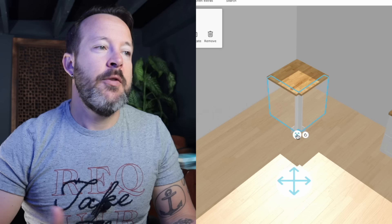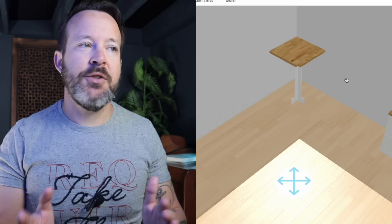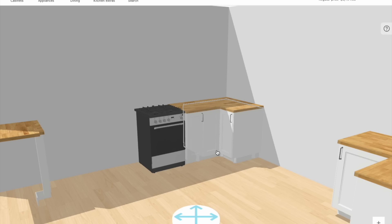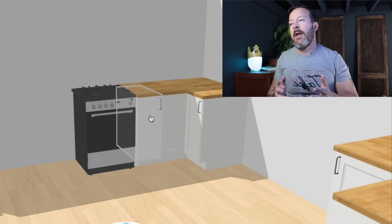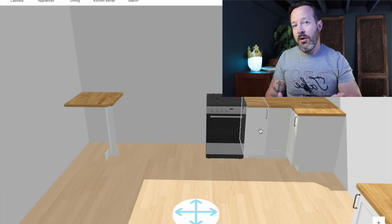This is a 4-inch by 4-inch corner filler, already set up in the IKEA kitchen planner — just two fillers on a 90-degree angle attached together. This allows you to create a blocked-off corner section with ease. Why would you do a blocked-off corner? Maybe you don't have enough room for a regular corner base, there could be a doorway or obstacle in the way, so you need to create a corner without a regular cabinet. This lets you use the space on either side of those fillers to better capacity. For instance, maybe you only had room for a narrow 12-inch cabinet next to a corner base and that didn't interest you — you can eliminate both and block off the corner instead.